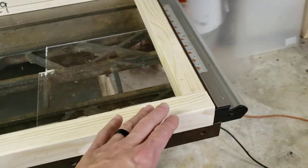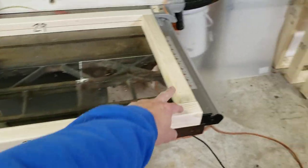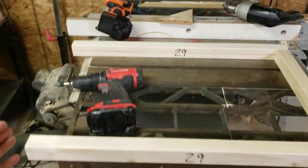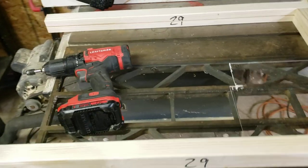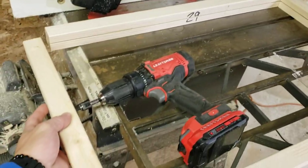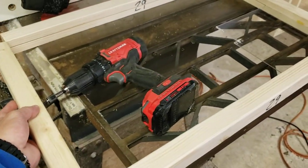I'll do that for my long edge, then flip it around and do this edge so I have an open-ended window. Then I take my piece of cut plexi, take off the protective shields, slide it in all the way. Then I attach another piece here with the cut side down and go in like so, securing the window. So I have one screw into all.